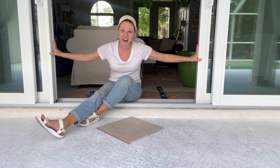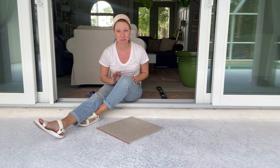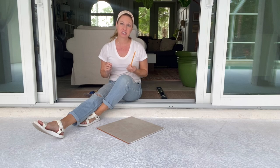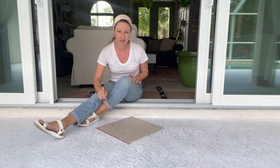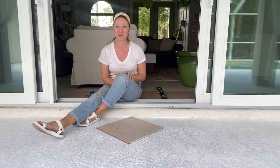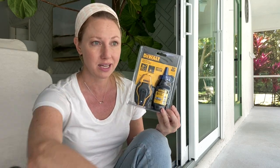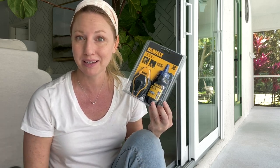I just have to figure out how I'm going to draw the lines, because my plan is I don't want to tape. So I'm going to end up drawing the lines and then just painting freehand. I'm going to use an artist's brush around the edge and then use a roller in the middle, so hopefully that'll make it go faster because taping this whole area would take forever. My other idea — I have no idea if this will work — was to use a chalk line, snap it down, and it would leave a line. So this will be another experiment.